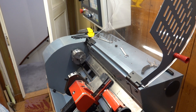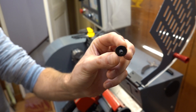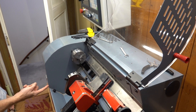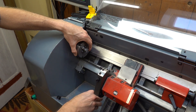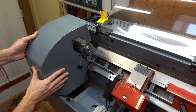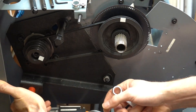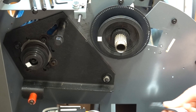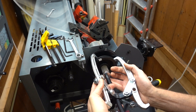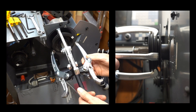First, the spindle has to be removed. Be prepared for some unconventional techniques, as this is the first time that I am replacing spindle bearings and I may not have the right tools. Before I started this I had to remove the spindle cover. There is one screw that is particularly hard to reach, as it is inside the cabinet between the bottom plate and the underside of the spindle. Like most parts on the lathe, the headstock is tiny. Next, I am removing the pulley and the old encoder ring with a pulley puller. I use a fender washer at the tip of the tool because otherwise it would just disappear into the spindle bore. It can be a bit difficult to align everything when everything is still loose. There is only little force required here, so I might have been able to pull it off manually, but this is much more controlled, and I need the pulley in one piece so I can reuse it.